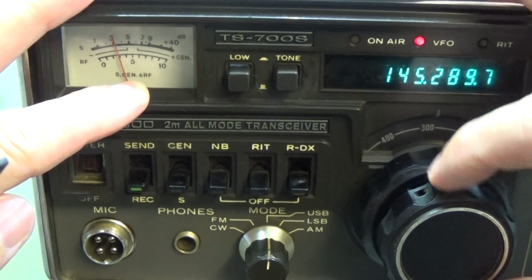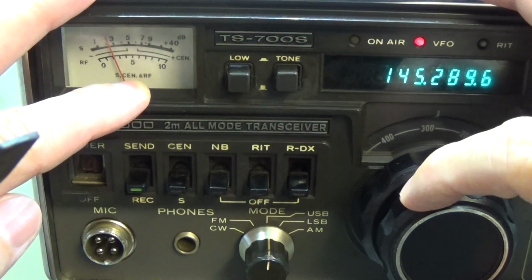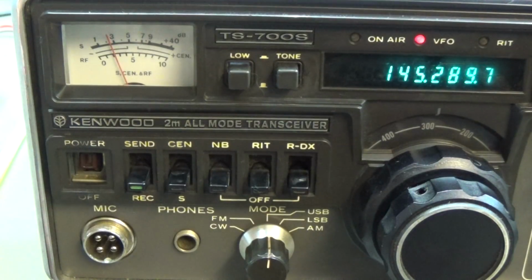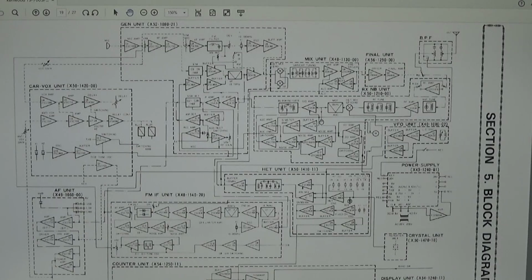So we really have to set the master oscillator and the local oscillators and whatnot to be able to have the right preset, and then we can go through our FM board and our RX noise blanker board, because we get information for our S-meter adjustment on FM. So we get a feedback voltage from our FM unit.